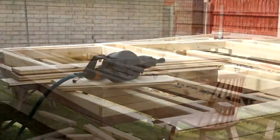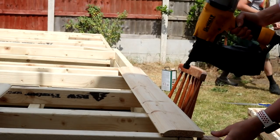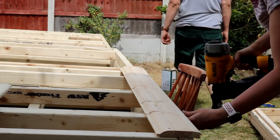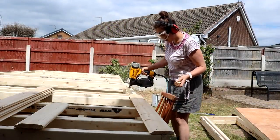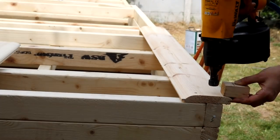Now to clad the opposite side, but this time we're using strips of cladding. I'm using the same overhang reference block and nailed it down with a nail gun. I'll leave a link to everything we used in the description box below. My dad recommended getting that first one straight and nailed down, flush with the end, as I'll be adding a trim later.